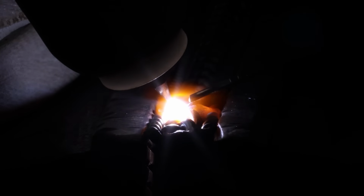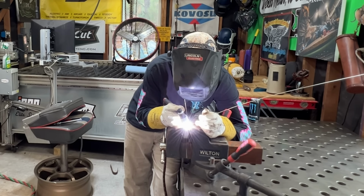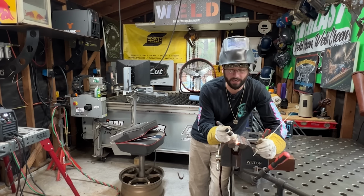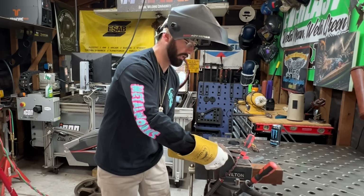You can fill as much back as you want. Again, we're looking to fill in any cracks. I've got full control, manipulation over that foot pedal. The sides where this twisted wire is on the sides of the bracelet are going to give us some trouble. We're going to just make sure that this whole end is just a nice wad of metal, because we are going to do a little bit of heating and hammering and do a little bit of sanding and polishing, so you can fix a lot of the ugly. Let's do the other side.